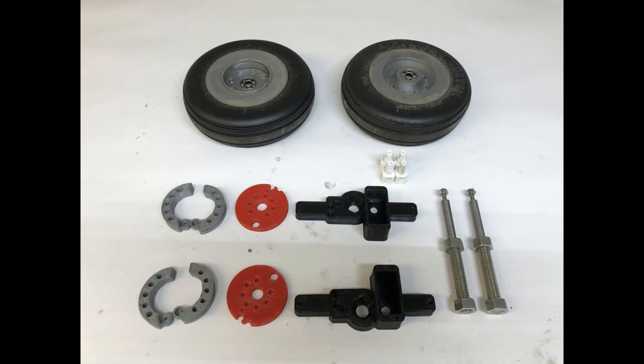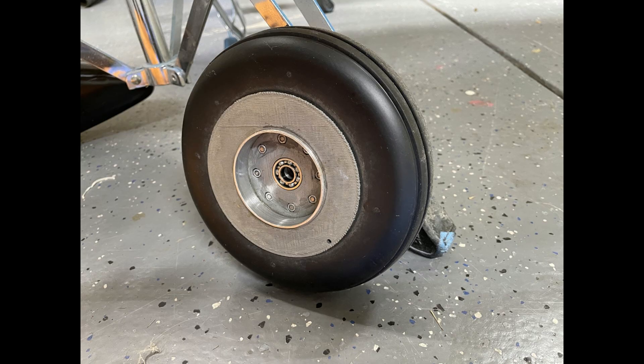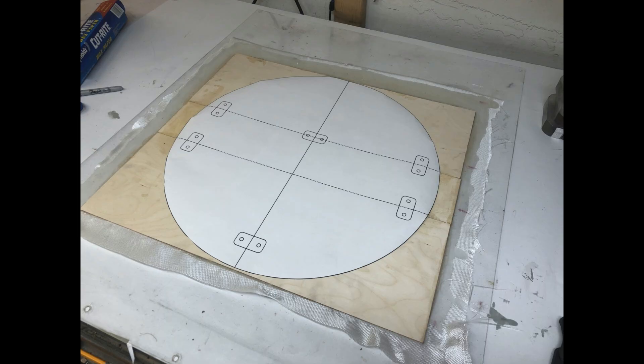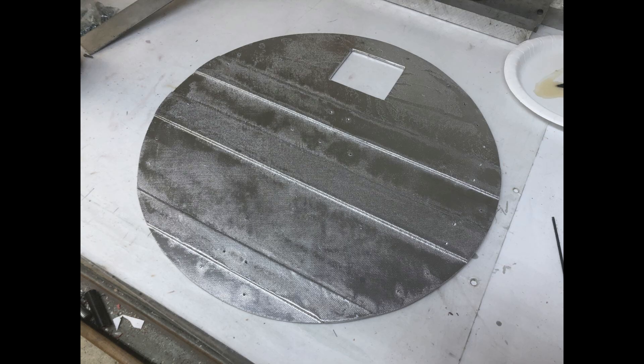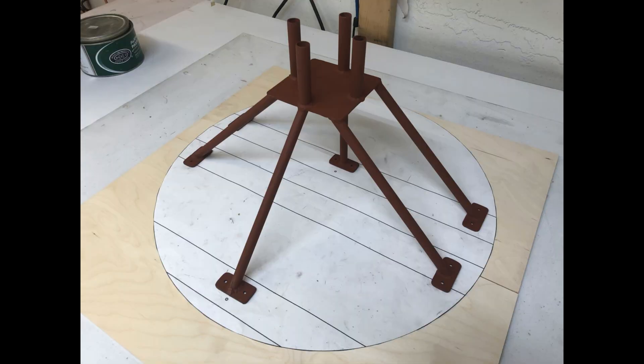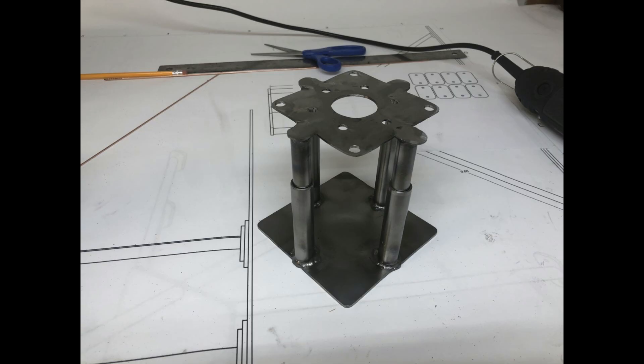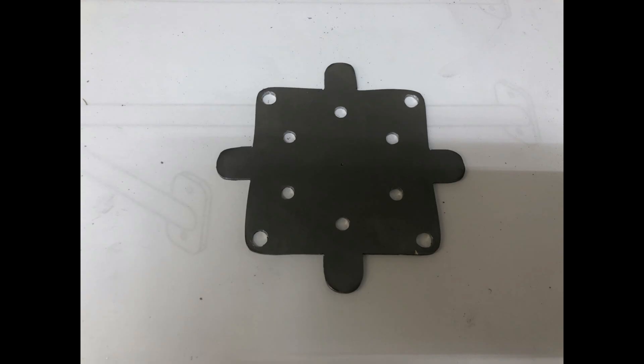If you've got all the tools, doing this stuff isn't that hard. I 3D printed my rims and my brake system — servos activated it. The brake shoes work kind of like an old Volkswagen Bug brake system. The liner inside the 3D printed material is 6061 T6 aluminum. The firewall was very important and needed to hold the motor, so I used fiberglass and plywood to make it. The motor mount I TIG welded with 4130 chromoly — it was extremely light and extremely strong. Ignore the naysayers who said it would twist; it worked perfectly. I made it telescopic so I could get the prop adjusted just right on the cowling. All of this was hand cut with the metal band saw, which is very important to have.